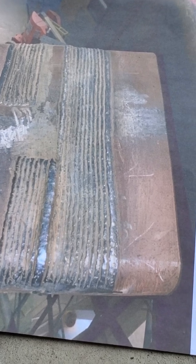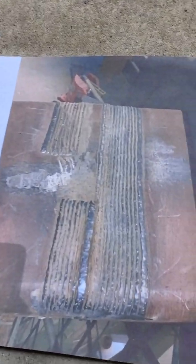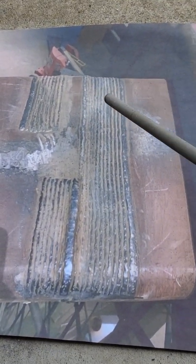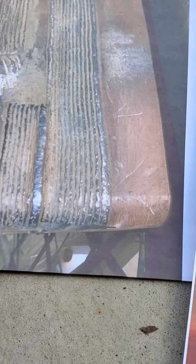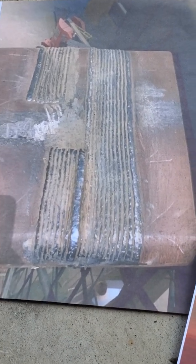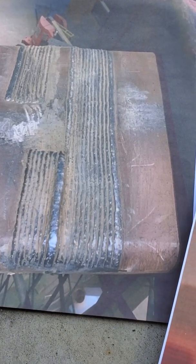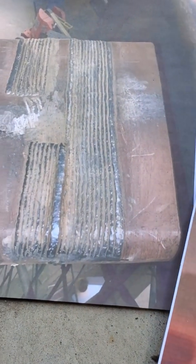This was a high-low issue in the fab. Basically, somewhere they spliced it in the fab because they made it too short. They just screwed up on the fit-up — a tack could have cracked. They had a high-low, so he had to build it weld up, as you see.